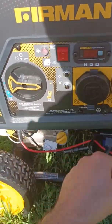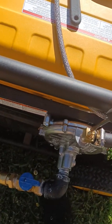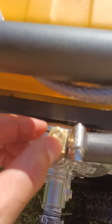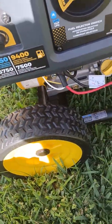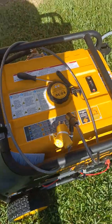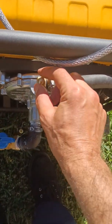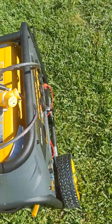It's not working. All right, let's do what it says — checking all the valves are on. We're going to loosen the nut a little bit and go another half turn. It doesn't sound good. Yep, it went out. Part of it could be a little bit of air in the line; another part could be we have to do this a little bit more. I went in another half a turn — let's see what's going to happen now.